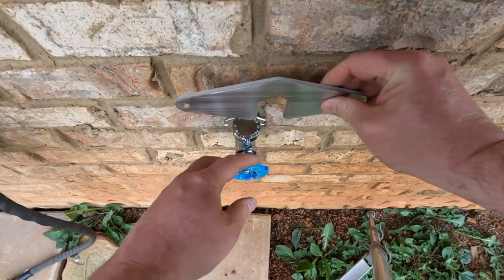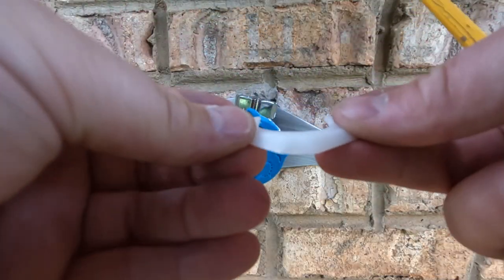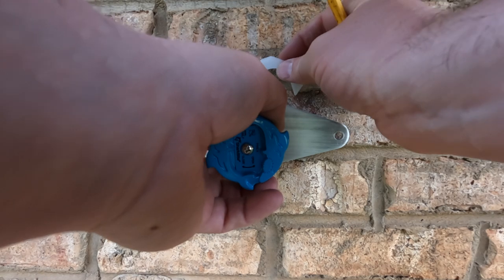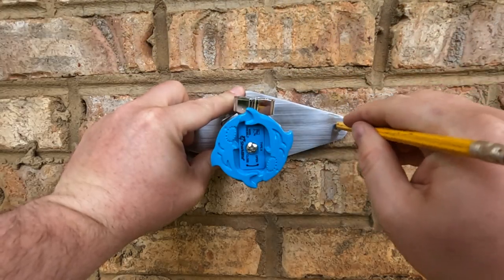The first thing I do is get the Bib Buddy positioned as straight as possible so I can mark where the TAPCON pilot holes will go. My sill cock did come with this angled back plate. The purpose is to ensure you're installing it at an angle so the water flows towards the spigot instead of back into the pipes. However, since my hole in the wall wasn't straight, I could not use it.